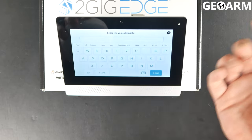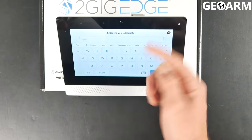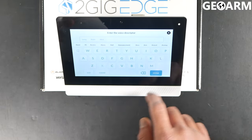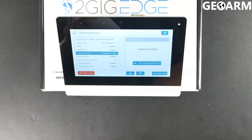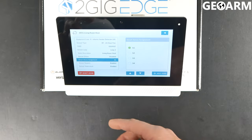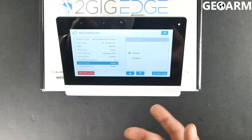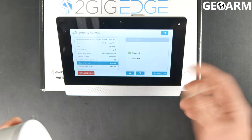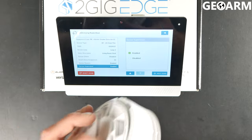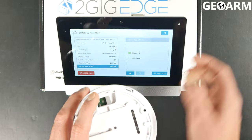You want to put your voice descriptor in there — in this case I'll just call it living room. It actually kind of auto-populates choices for you, so we're going to go living room heat, then hit done. At that point our voice descriptor is programmed in there. You don't need to chime on this because this is a heat detection device. Smart areas assignment, I'm going to leave it on S1 for the first area. Sensor reports, we want that to be enabled so it'll report any heat or alarm. And sensor supervise — this is so it checks in with the system. At this point, this heat detector has been learned in and it is ready to go.